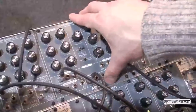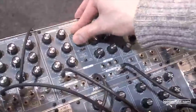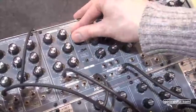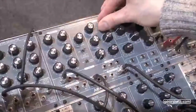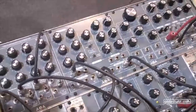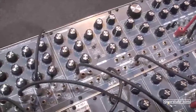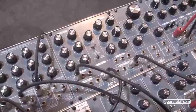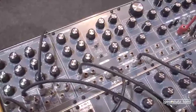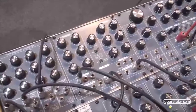The filter is made with a very high quality technique, so it's usually of nicer quality than, for example, OTA-based state variable filters. For the nerds. Right. And you made it by hand? I made it by hand, yes. It's completely made in Berlin. It's basically SMD, because the PC board is quite packed.